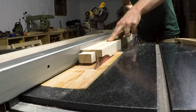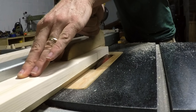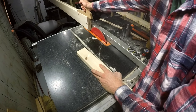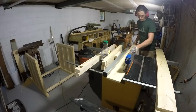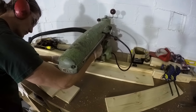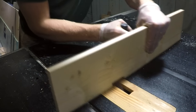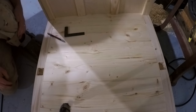I quickly knocked down the corners of the end panel components with a hand plane, then turned my attention to the floor of the island. First I cut a rabbet in the lower rail using that additional material I referred to earlier. For the floor I took some two-by-six material that had been planed on both faces, re-sawed them in half, jointed one edge, and ripped to a clean width. I cut them to length on the radial arm saw, fit them into the base, and the two outside pieces had to be notched to fit the end panels. I ripped several down until I got a nice tight fit.